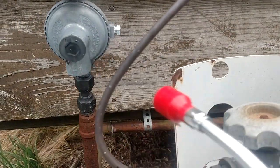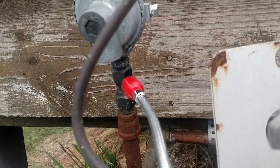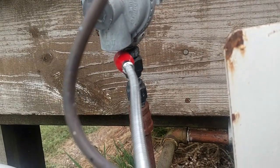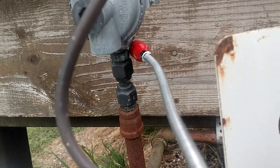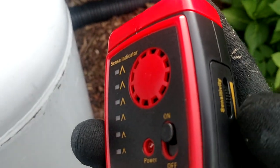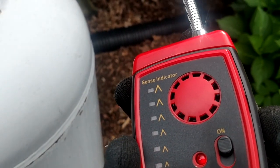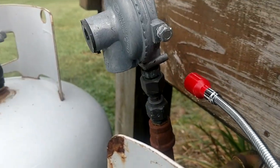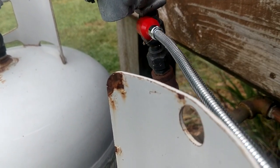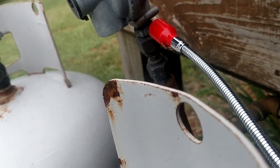I'm thinking most of it is coming from right up there where his grill is at. Usually a lot of times the bottom joint — like on a gas meter, natural gas, that riser coming out of the ground — is a lot of times where you'll get your leak. We got a little tick there, I'm turned down to real low sensitivity. If I want to dial it up just a little smidge on the sensitivity, increase that tick sound just a little bit, then we can come back in here. Let's check this joint again. Yeah, there's definitely something right there.